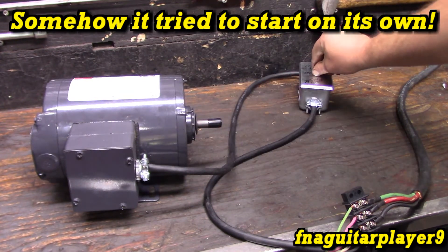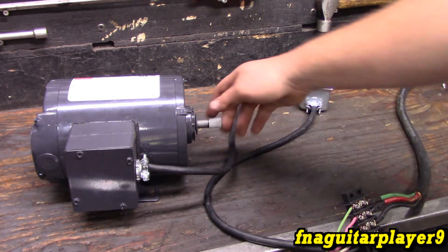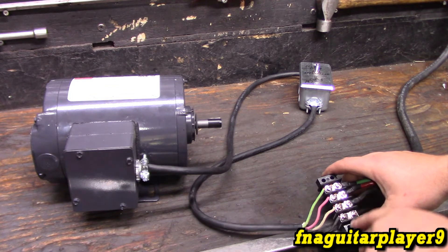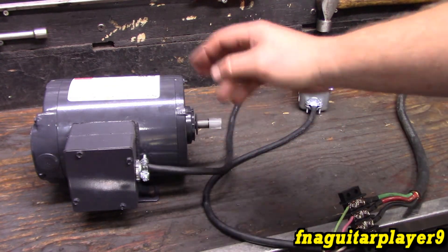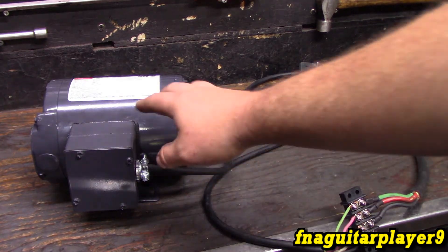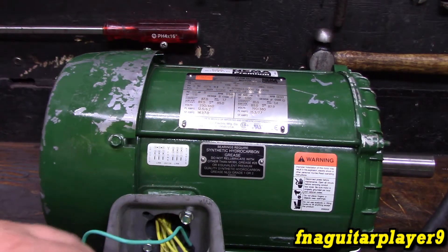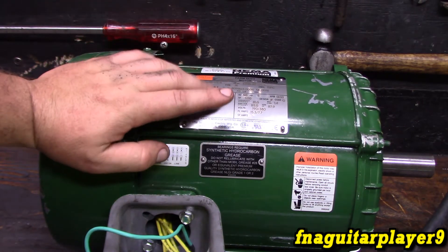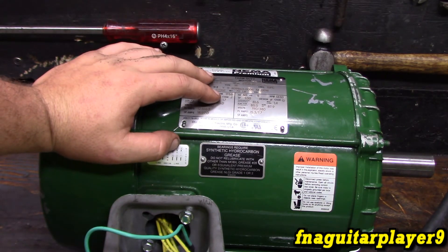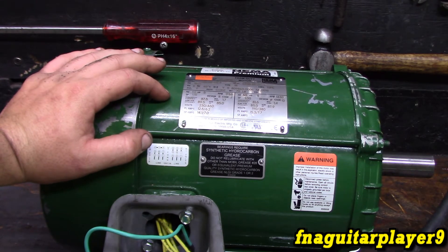You can start in either direction. You can put a full load on there and it'll have the same horsepower as the nameplate. Even though this is a small one, it's actually still generating that third phase, so if you had a real little tiny motor you can run it off this and use this as a rotary phase converter. You'll see more about that in part three on rotary phase converters and phase rotation meters. Now I'm going to disconnect all this — it's going to be the end of the first video on three-phase. The next video is going to be on a variable frequency drive, where we'll talk about ramping up, ramping down, and what I can do with the inverter I picked out.